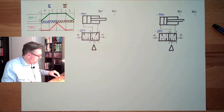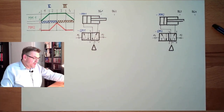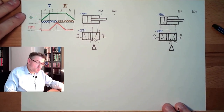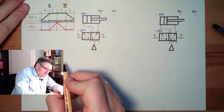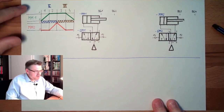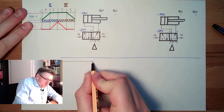The basic idea is that we subdivide our control, or that we use our pressure lines or signal lines only in the part where they are useful to us. So basically, we have two different signal pressure lines for those two cases. Here we have pressure line one, which will be under pressure if we are in this area. And then we have pressure line two, which will be under pressure if we are in area number two.